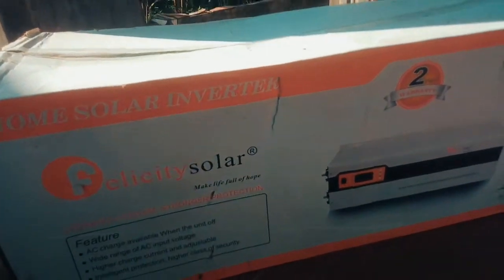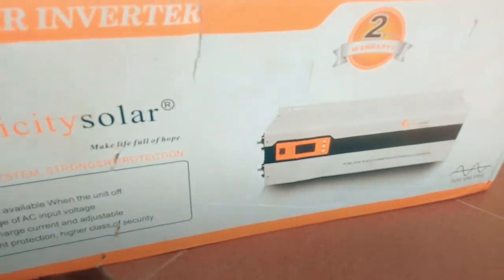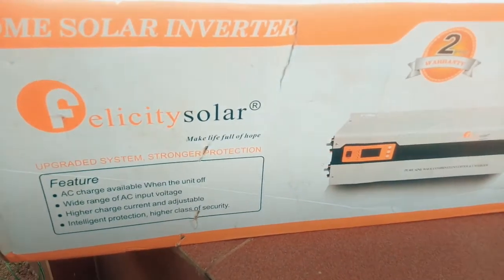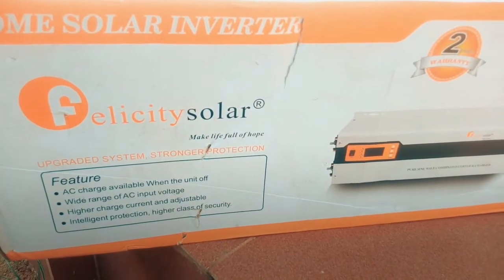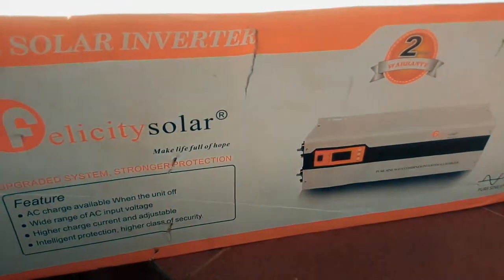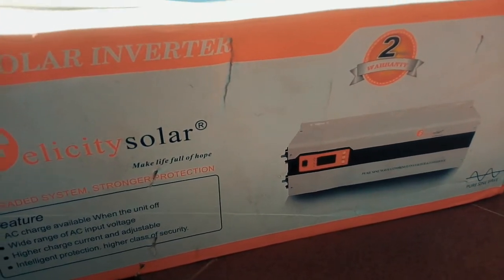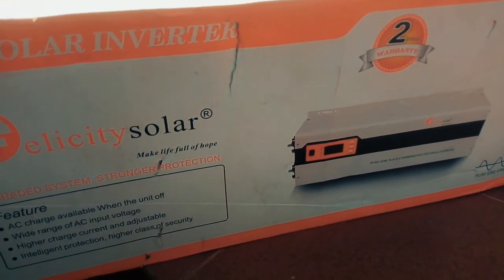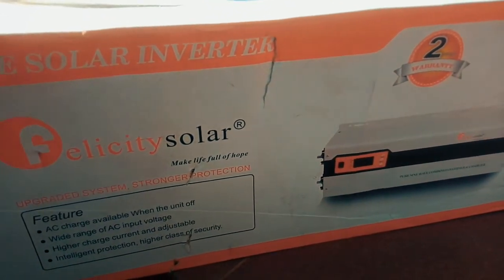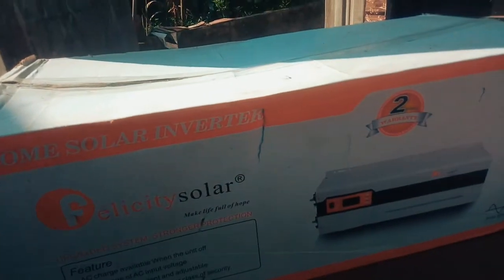One thing I love about this inverter is that it's a low frequency inverter — it's actually a power inverter. Being low frequency means it is rugged for handling power tools, high induction loads, and things that have spike surge currents. It's awesome for that. In the next video I'll be unboxing this, bringing it out, we'll see what it is, and get it all fixed up in our solar powerhouse.